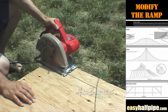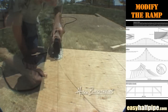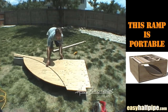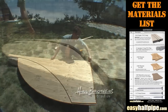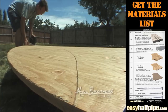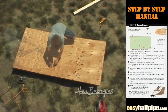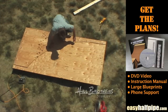With the plywood raised from the ground, cut out the transition. Be careful not to cut over the curved line. Flip the newly cut transition over diagonally and trace the curved line using the first transition as a template. Cut out the second transition and discard the surfboard section. On the second sheet of half-inch plywood, cut out two more transitions using the first transition, which ensures a more accurate duplication.